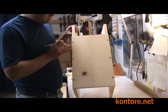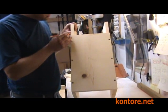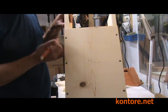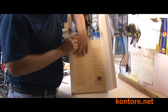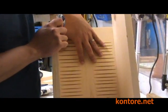One thing to be careful of: try to center your screw into the center of the side you're going into. Don't go too close to the edge or you risk splitting the wood. This is an inside view of the unit so far — you can see the slots are on the inside. These slots are optional; if you have the equipment to make them, go ahead.